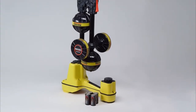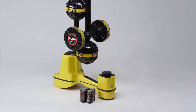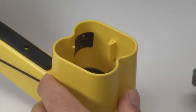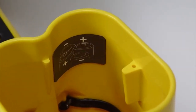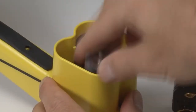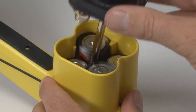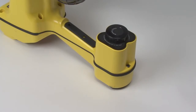The SR20 operates on four C-size batteries. To install the batteries, locate the battery compartment on the bottom of the receiver and turn the locking knob a quarter turn to release it. Install the batteries with the correct polarity as shown on the label inside the battery holder. You can use either alkaline or rechargeable batteries, but to prevent damage to the receiver, never mix rechargeable and standard battery types. When you've loaded the batteries, slide the holder back into the receiver and turn the locking knob a quarter turn to secure it.